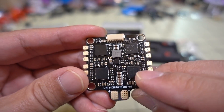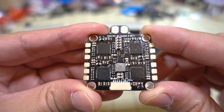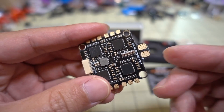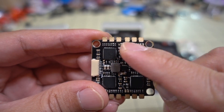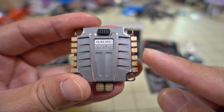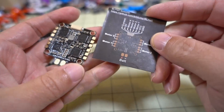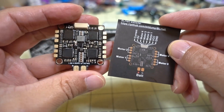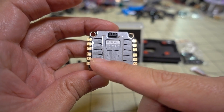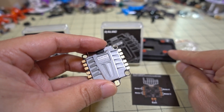On the underside you can see a glossiness — that's conformal coating to protect against water damage, which is a nice touch. There are nice big pads for your motor wires and battery leads, and a nice heat sink to absorb heat from the MOSFETs. On top there are additional pads for your motors. According to the documentation, when mounted correctly with the battery out the back, motor one is here, motor two there, then motor three and motor four. You'll want to use the vibration dampening since the mounting holes are M4 and most screws are M3.